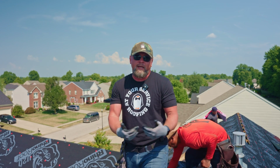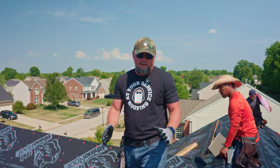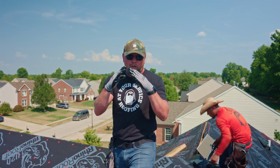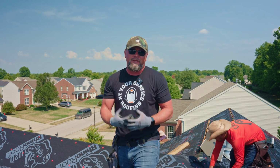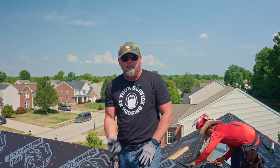So this roof already had the ridge open for a ridge vent, meaning if we were going to switch to box vents or gable vents, we would have to replace all of the plywood along the top in order to close that back in, then cut 6 inch by 6 inch holes for those box vents. All that would do is actually reduce the amount of exhaust that's open to allow that hot air to leave.